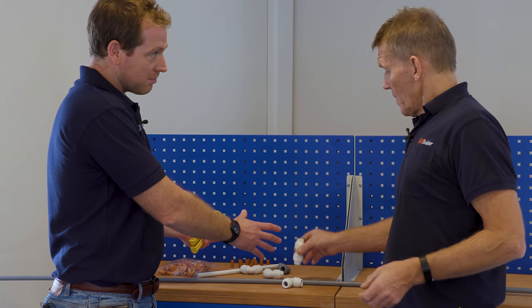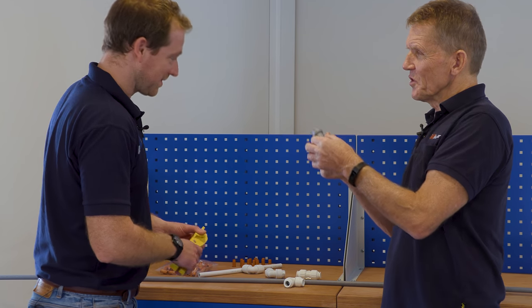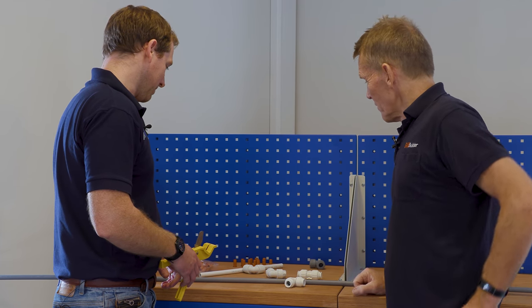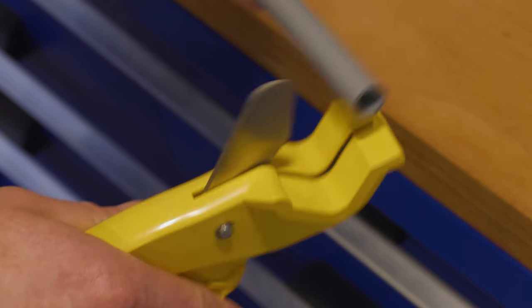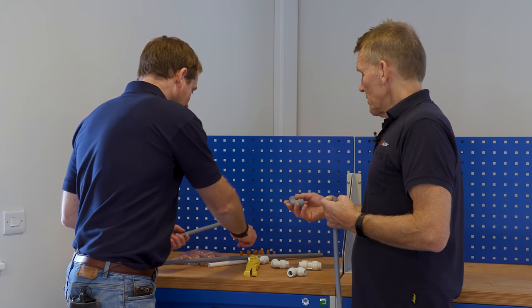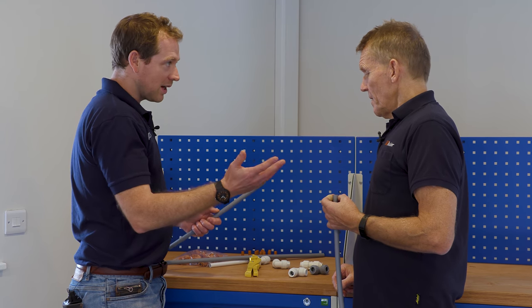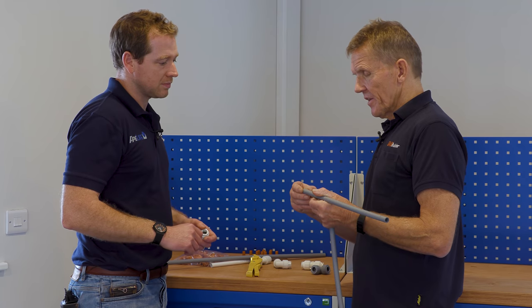They're all variations on a theme, but they're all British standard fittings — and that's the important thing. If it's a British standard fitting it's compatible with our British standard pipe. The one I'm not a fan of is this one — the grab ring isn't demountable and I've seen people squash that grab ring and reuse it, so that one's not a favourite. Now we're left with grey pipe — compatible with any of these British standard fittings. Insert the liner as is always the case with any joint.